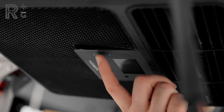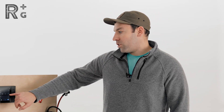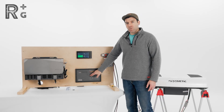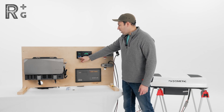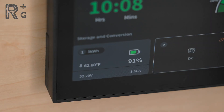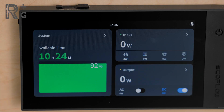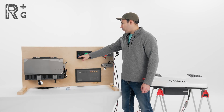We've got our main power cable connected and we're ready to turn the unit on. Underneath here we've got a blue light, 62 degrees at our set point — she'll start right up. The RTX is plugged in, turned on, and running. Notice the output is showing zero watts because we're pulling power for the RTX from the bus bars, intercepting it before it gets to the AC/DC distribution panel. We can go into the system menu to see our voltage and current being pulled from the battery — we're at 52.29 volts, negative 8.5 amps, pulling around 450 watts. The system will also show available battery time remaining.